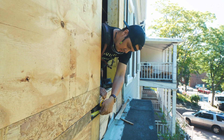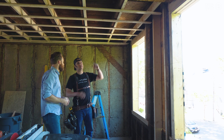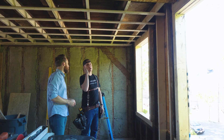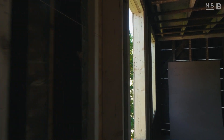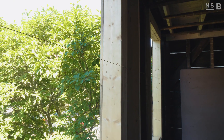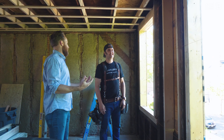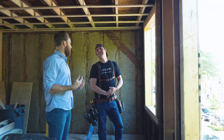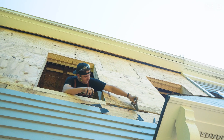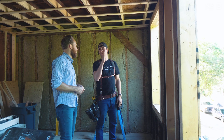It's still slightly bowed out. You had mentioned earlier that this is balloon framed up through the third floor — yes, from second to third floor it's balloon framed. We saw a little bit of sagging falling out vertically. You have string lines set up here from corner to corner just to get a sense of how far that wall is out. Right here it's about three-eighths to a half inch. When we were looking at the outside, it looked like inches. So we actually peeled the siding back and realized someone had doctored up the sheathing — the way they repaired it was not correct. They didn't fasten off the old sheathing with the new, so everything had been kind of falling off the studs.